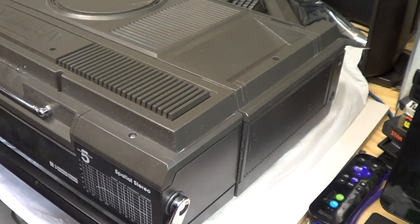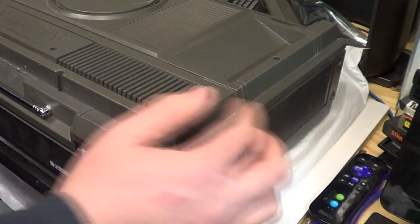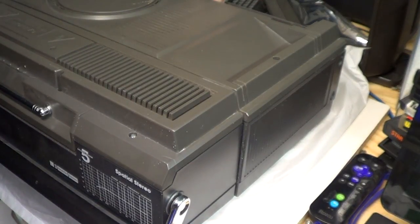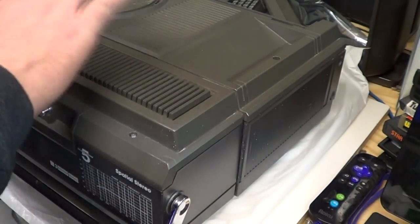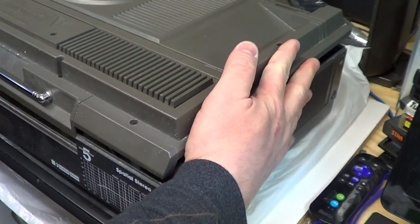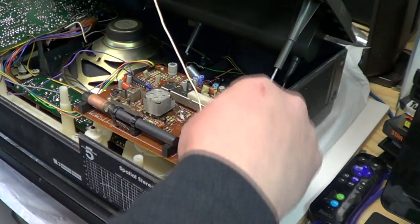When taking apart the Magnavox D8443, there's a series of screws all around the backside, including two inside the battery compartment, one in the middle of the battery compartment and one underneath one of the springs in the battery compartment. I have this unscrewed right now, so I'm going to go ahead and lift the case carefully. Go straight up. One thing you'll have to watch out for is this antenna connector.